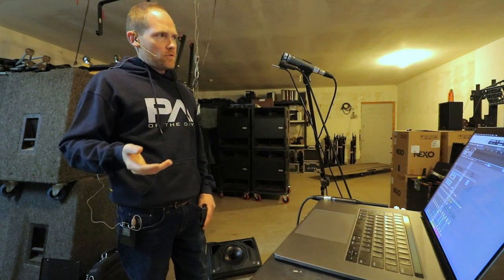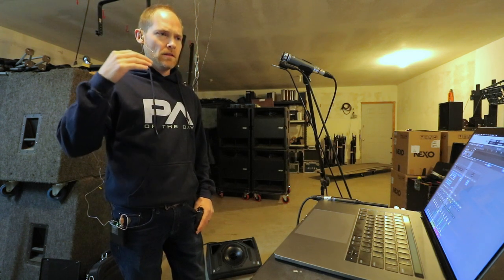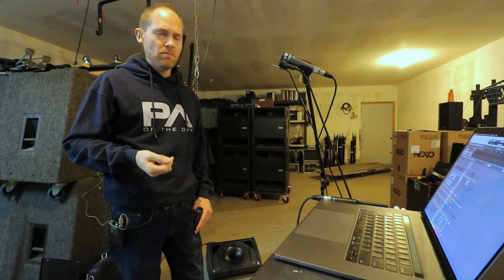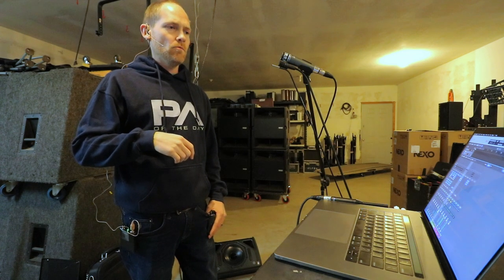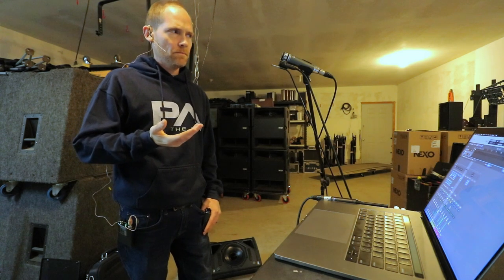So what I find interesting about this test already is just that we've neutralized the differences in the frequency responses between these mics. So that's normally what I think people would assume makes the difference between mics in terms of their gain before feedback performance, right? The differences in the peaks and the valleys of the frequency contour. But with that sort of out of the equation, as best we can do, what else is left? They still have different gain before feedback responses.